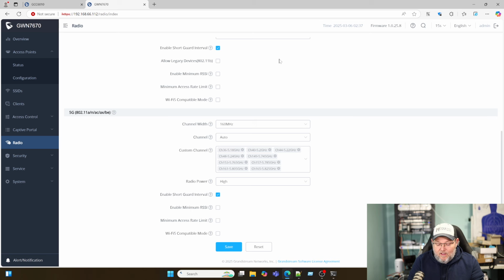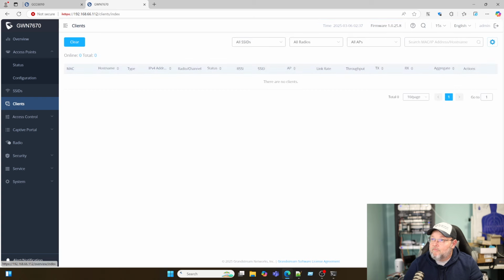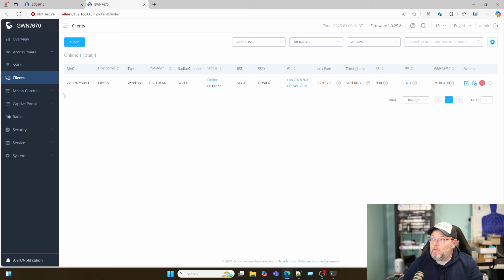All right, so that's saved. So let me reconnect to the network. It says I'm connected. Let's go to the clients. Might be negotiating here. Connected. Show me on the client page. Let me hop over to my other SSID and then I'll hop back over to this one. Now remember, we doubled that bandwidth, and there we go. So we're at a negative 45. Our link rate is 1.7 gig.